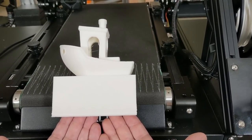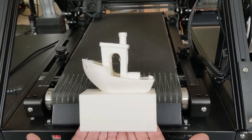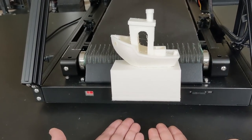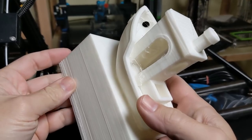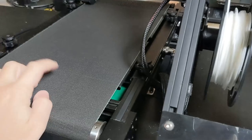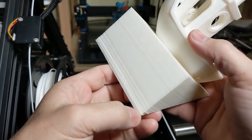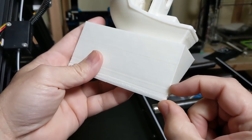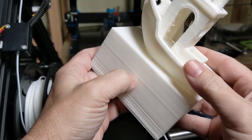I don't know if you guys can hear that, but I can hear it peeling off. How cool is that? Let's take a look. Got some exaggerated lighting going on here to really accentuate the flaws. Down here in the beginning of the print, the belt was doing some run-in — basically trying to center itself. Looks like by about the time we got to there, the belt was mostly stable. We do see some sort of layer shifting — not terrible, but not great.